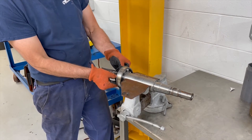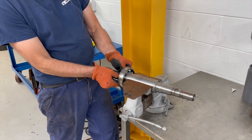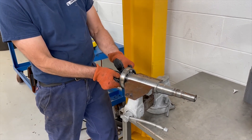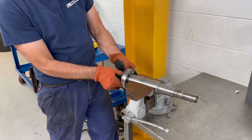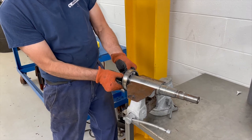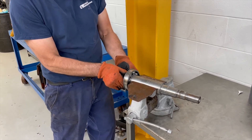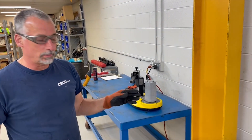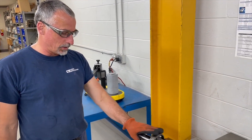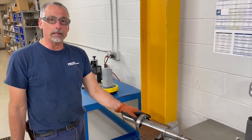We hold it and turn it a little bit to keep it from shrinking and coming away from the shoulder. Once the bearing cools down, the inner race won't turn anymore, so we know it's locked where it's supposed to be. We let it cool down, and since this one runs on grease, once it cools I'll pack it full of grease.